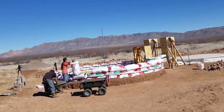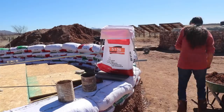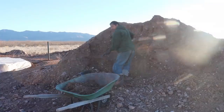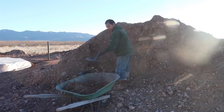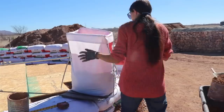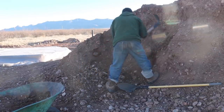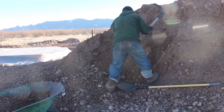But this course is a special one because, of course, I put in the pipe where I'll be running the electricity through for the house, the main electricity. It's a 1 1/4 inch PVC conduit. I'm thinking there'll be 4-gauge wires. I'll be running about 60 amps going from the shed to the house. And I know 60 amps isn't your typical amount of electricity for a house. I think it'll be enough for what we need. I mean, our trailer has a 30 amp service. It can only handle 30 amps. Yeah, and that's been fine for us for years now. And so this will actually be double the electricity output.